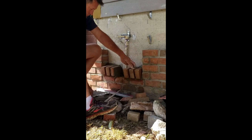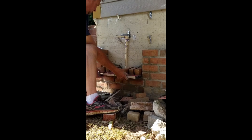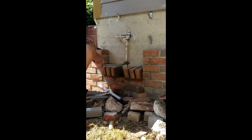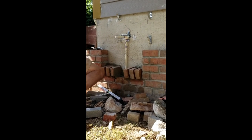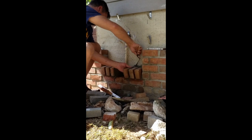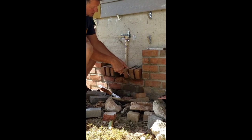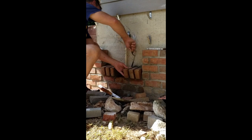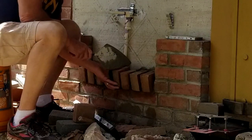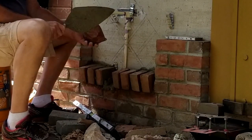Then I push the mortar in between to support each brick and let it harden into a good, dependable construction. I'm leaving the final finish and striking of the joints until after - just getting enough to support the brick and keep the gaps as uniform as possible. It's surprising how much mortar it takes to bed the sill and the water table on top because of that angle. You want to always start higher so you can tap the brick into the correct position - starting lower just doesn't work.